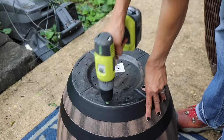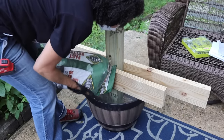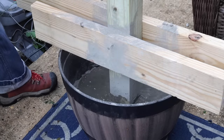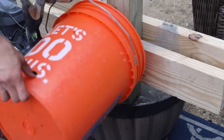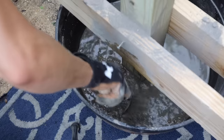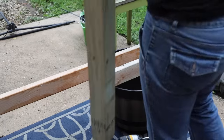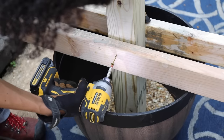I wanted to put some drainage at the bottom, and yes I knew some of the concrete would leak out — that's okay. I didn't want water to just sit in the bottom when it rains, so I did some holes for drainage on the bottom and then some holes around the top as well. I went around and set each of the four posts, letting them dry — it starts to set in about 30 minutes but I left them overnight to make sure it was completely set before removing the braces. I also borrowed some pea gravel from my fire pit to add extra drainage in the bottom. Make sure you're wearing a mask because when you're pouring concrete it gets everywhere.